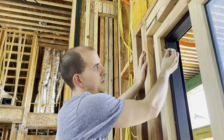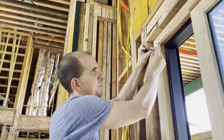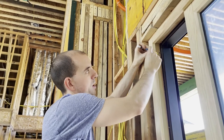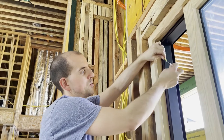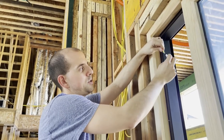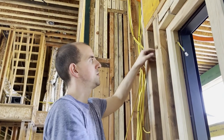For the alarm contact, we've got 22-4 yellow wire here. We've got two of the conductors bent back and put a B-type on to create a loop for those. And then for the other two conductors, they're just in a little screw-type terminal. This is a 3/8-inch alarm contact, and it's coming through some 3/8-inch holes we've drilled through these studs.